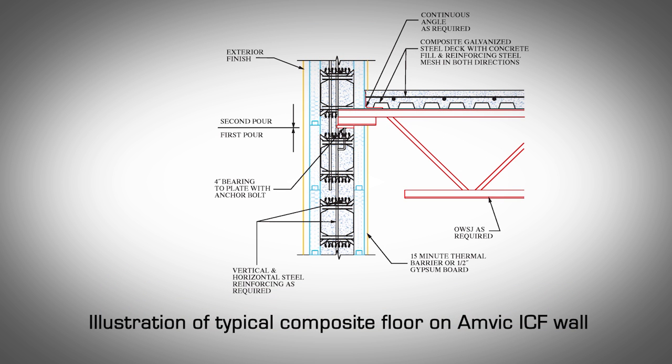Composite steel deck. Composite steel decks are made from plain or galvanized steel sheet rolled into rib profiles. The ribs are typically three inches deep and six inches wide, spaced at 12 inches on center. The steel deck can be used strictly as formwork for concrete, or fabricated to bond with concrete and act together as a composite section. For composite deck, no additional reinforcement is typically used. When non-composite deck is used, reinforcing steel bars are placed in the slab. Generally, two to three inches of concrete is placed over the ribbed deck to form a total slab thickness of five to six inches. To install with AMVIC ICF: pour concrete into the walls to the underside of the concrete slab, wet set dowels as per engineering requirements, then install the steel decking and reinforcing steel as per the manufacturer's technical engineering manual or as specified by a local licensed engineer. Pour concrete for the composite steel deck.